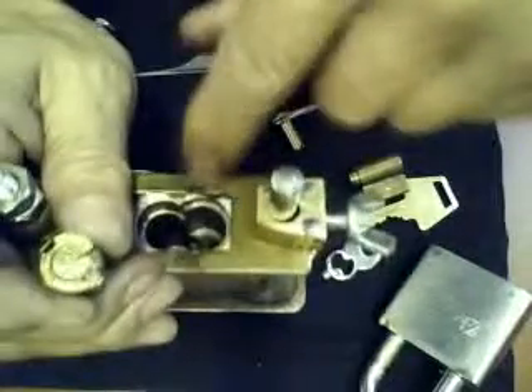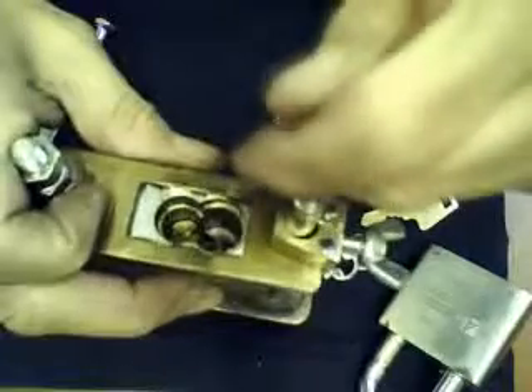In this main mechanism there is a slot on the side which has to go into the bottom of the padlock. All you have to do is look for that slot, drop this down there, and push it a little — it will find its way because the shackle is depressed. Now you can install the new rekeyed cylinder, and then put the armor plate on. We will have to take it out from the compressor device first.